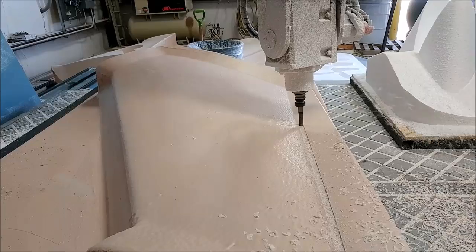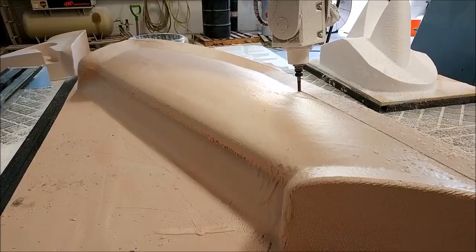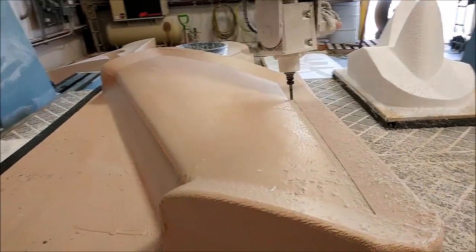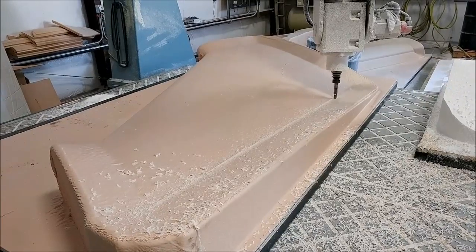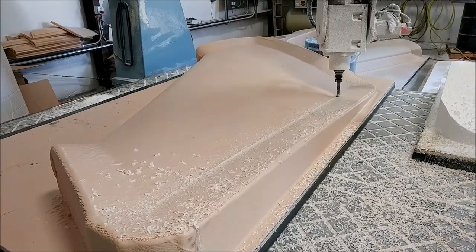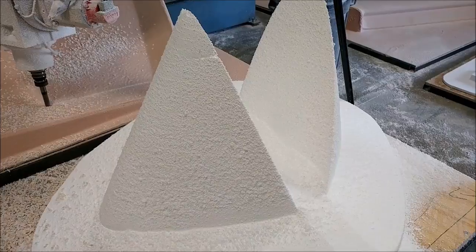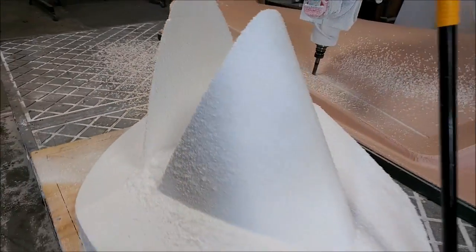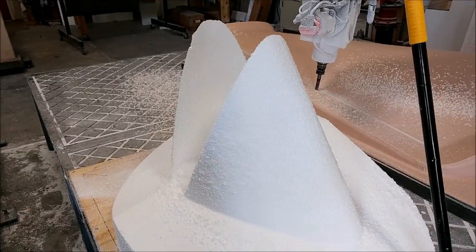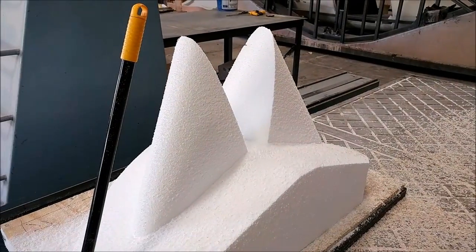With that one done, it was time to switch over to the left-hand side upper wing strake plug. This is just starting now, cutting the first part of the flange. You already saw the right one the other day, so this is basically the mirror image of that one. Here's a better look at these particular ones for the door strakes — each of those will make up one part that gets bonded to the door skin and mates up with the leading edge of the wing.